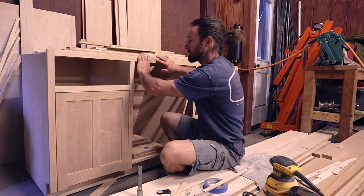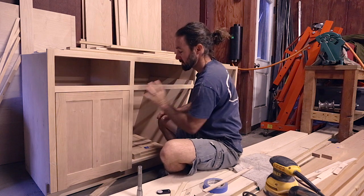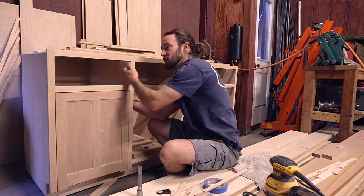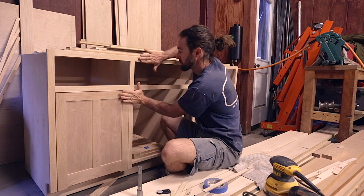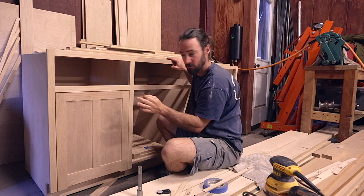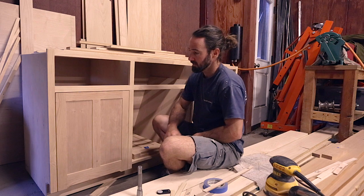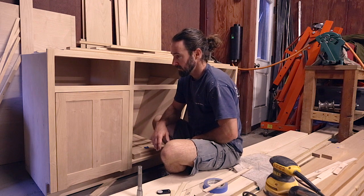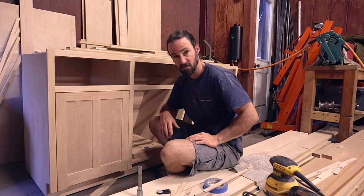The first thing I had to do: I usually sand the face frame last after I put it on and have everything assembled. I sand the insides before I assemble because that way you can get to the corners. But the face frame — this plane here — I did last after it was all assembled, so I can get it nice and in line with everything. That was one of the first steps. Now let's go take a look at one of the door faces and see how we're going to process that.